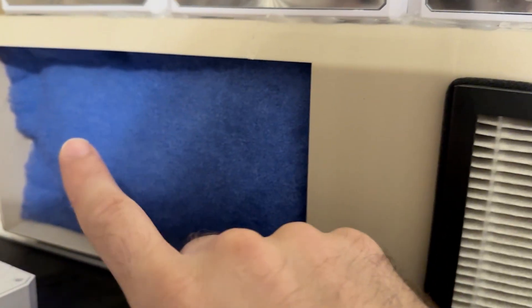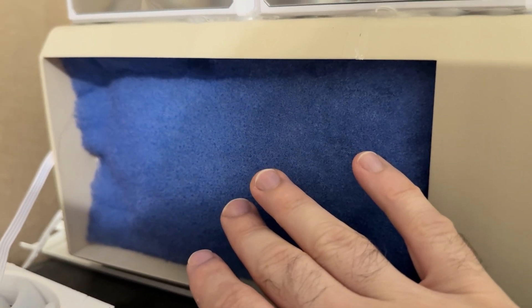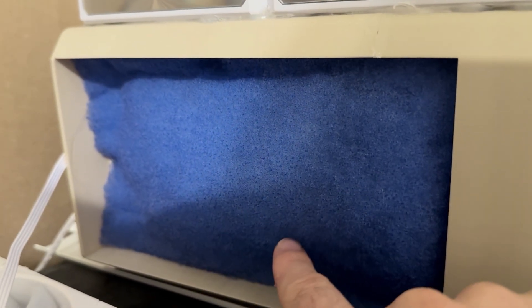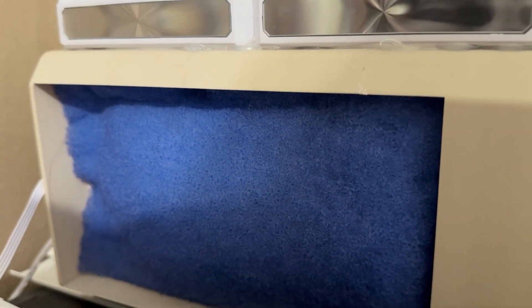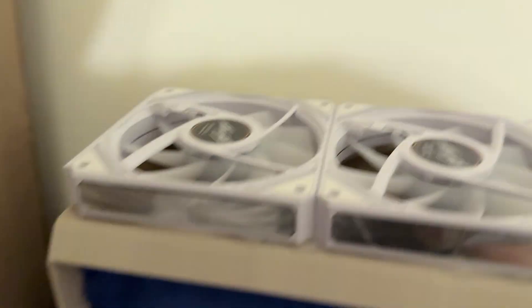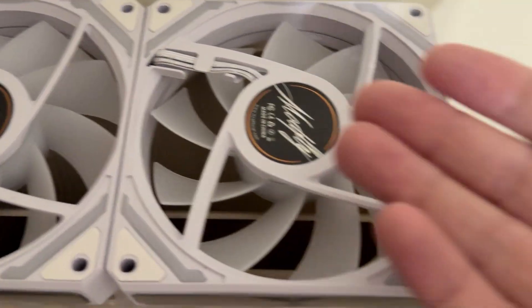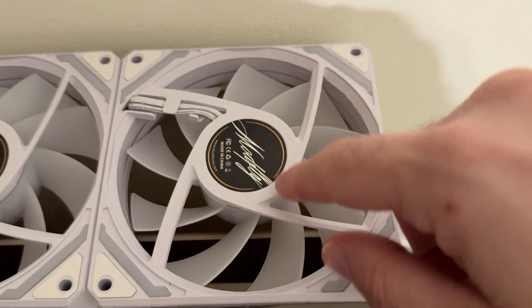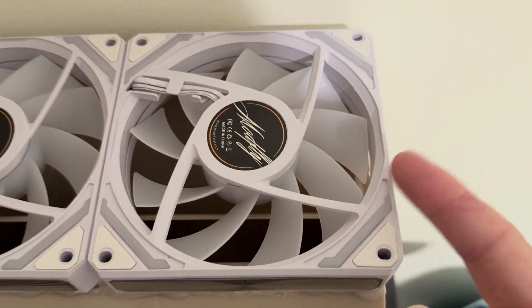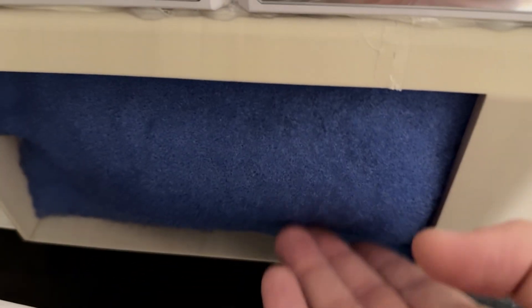So I've scrapped going HEPA, and instead I got a MERV-8 filter. In a couple of small sections, I have a carbon filter behind it, and that allows for more airflow to cycle through it. Air is supposed to be pushed out of the fan, right? But I could feel air being drawn back in around the hub, meaning air was being pushed out and then being pulled right back into the inside of it. So very little air was actually coming through.